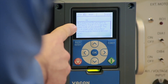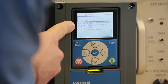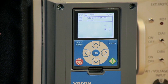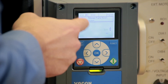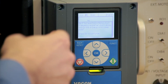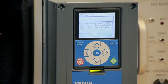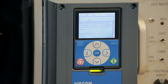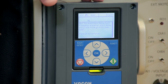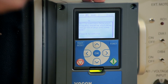Next question: do you want to configure the drive to go into sleep mode at low demand? The drive stops when the output frequency goes below a defined level and starts again when needed to maintain the feedback value. We want to put the drive to sleep when it's not needed, so we click yes to configure the sleep wizard. The drive asks: below which frequency and after which delay should the drive go into sleep mode? We'll use below 50 Hz, and for this demonstration we'll change the delay to 10 seconds — in real life you can program it however you like.